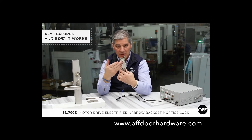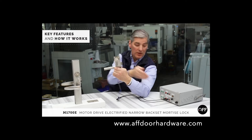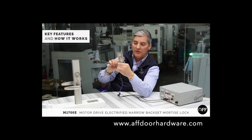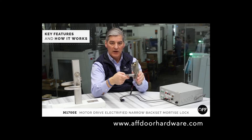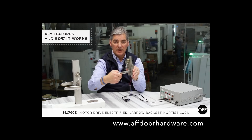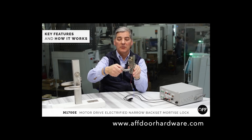So this is the exterior side and this is the inside. The inside on the lock is always free — whether power is on, I'm free; power off, I'm free. On the outside it is now locked, I can't rotate it. Through a credential, power is sent to the lock, the outside trim electrically unlocks, you remove power and it re-locks.